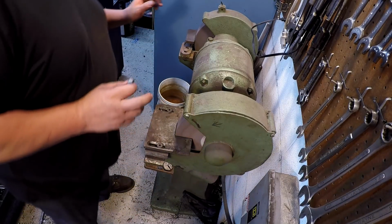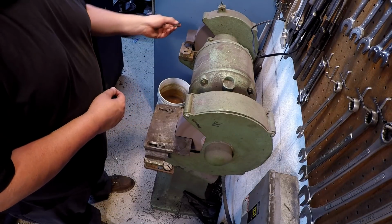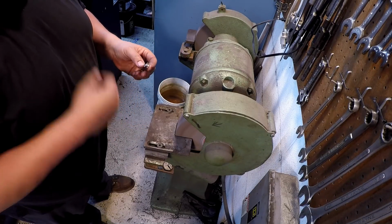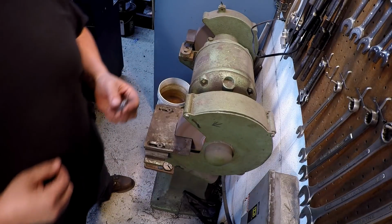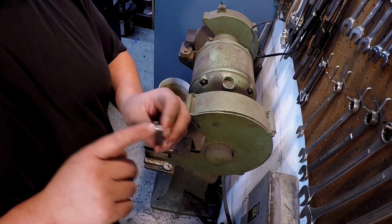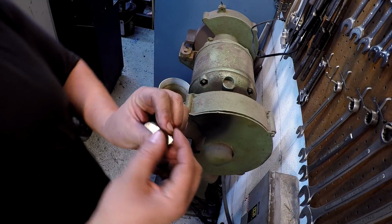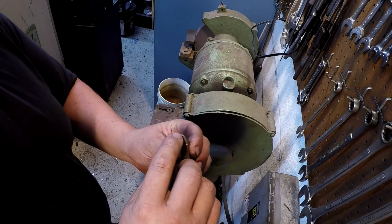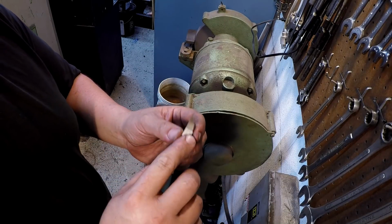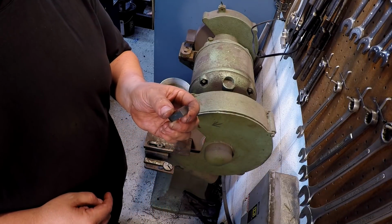All right, we got the coarse wheel on that side, the fine wheel on this side. So I'll try to get it roughed down on that side, and then we'll do our finishing there. And when you're grinding these kind of tool bits for like your bore, you have to take in consideration clearance. You got to have clearance underneath your cutting edge. That's why it's kind of radius like that. That's a little bit extreme, but you got to have clearance, and you got to have side clearance underneath this edge as well.